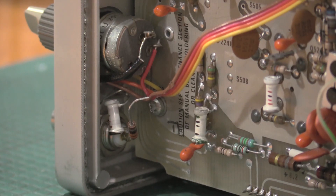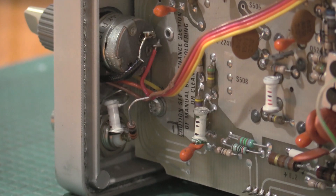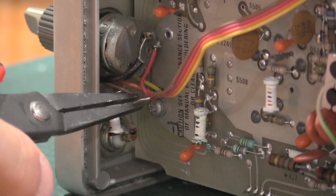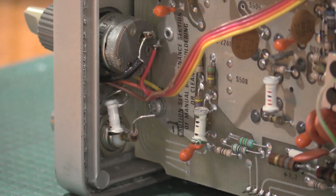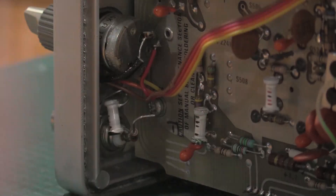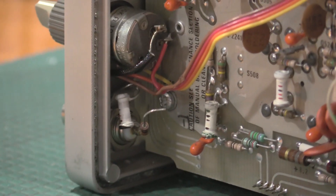As I wait for a soldering iron to warm up, I was dealing with the external trigger. The external trigger is not going to work when it's not connected. From taking the trigger boards out and doing all the troubleshooting, I have to re-solder the pins for the BNCs. So I will do that and we will be right back.